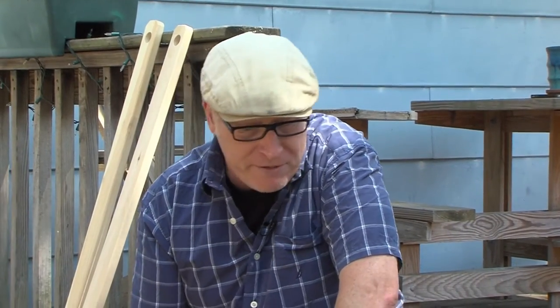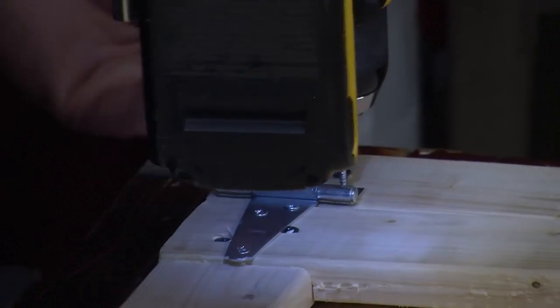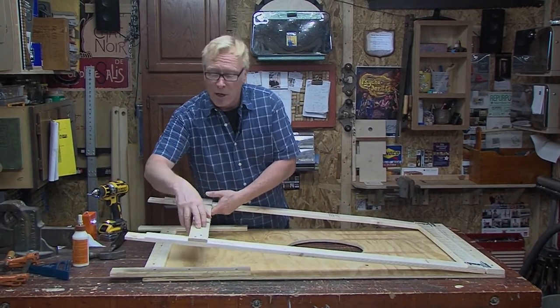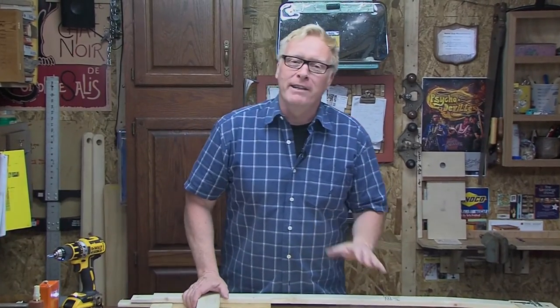About finishing — we just left these bare. They can weather and turn gray. You can put some wax or paint the end grain, especially on the two-by-fours, or just paint them up in fun primary colors to make them look more like a kids' playground. We've attached our T hinges, attached our frame with lap joints, glue, and screws. The only thing left is to paint the outside and get playing. I had a great time building these projects with you — I hope you'll come back and see us again here in the garage.